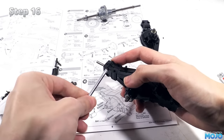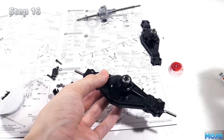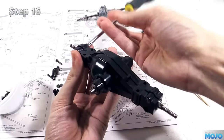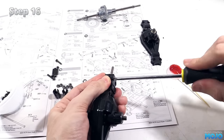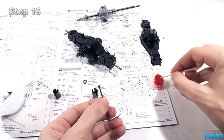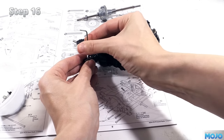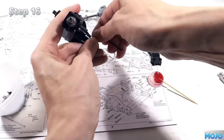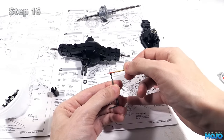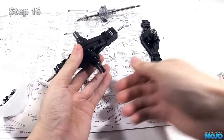Now the axle is not going to fall apart, we can fit all the rest of the screws. This time we need to use some thread lock on them — we want to avoid getting any on the plastic as much as we can, so pop a screw in and carefully smear a little bit of thread lock on the exposed thread, then install the nut and do up the screw. Work your way round, not forgetting to take out the first one and thread lock it too. Nearly there — grab a grub screw and pop it on the end of the allen key. Smear a little bit of thread lock on the threads and install it a turn or so into a drive cup. Slide the cup onto the shaft, lining up the grub screw with the flat, and do up the grub nice and tight. The cup and the grub are steel, so they'll take quite a bit of torque. This being the centre axle, we've got two drive cups, so the other one needs a bit of thread lock too, then it gets installed just like the first one, lining up the grub with the flat on the shaft. And there's a centre axle ready to fit.